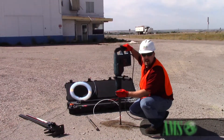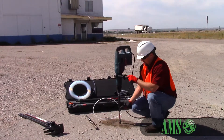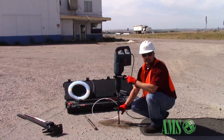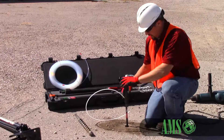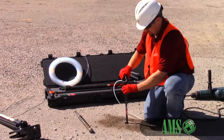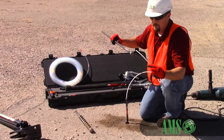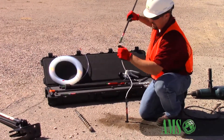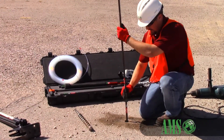You always want to ensure when you're driving these rods to at least leave about a six inch gap, because this extension drive adapter is how you're actually going to remove the rod from the ground — you've got to get the jack underneath there to pull it straight up. From here, if you want to go deeper, you would unthread your extension drive adapter and thread on another three-foot rod, feeding your tubing through.